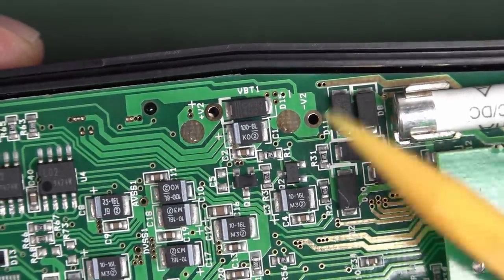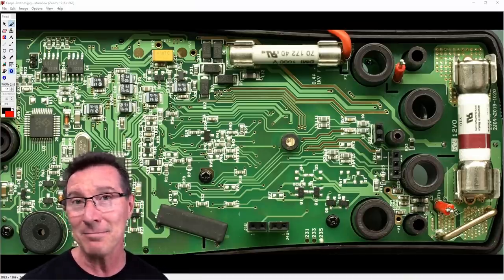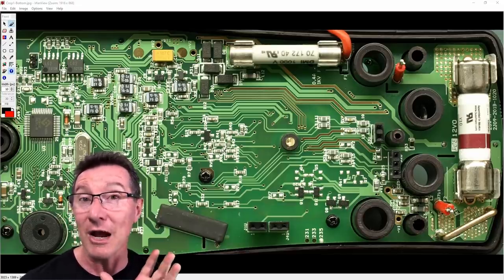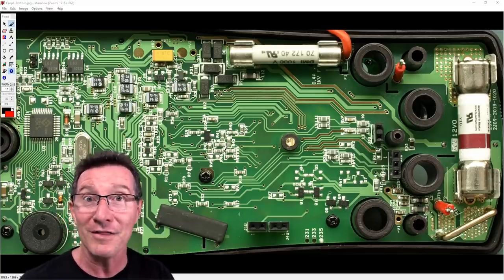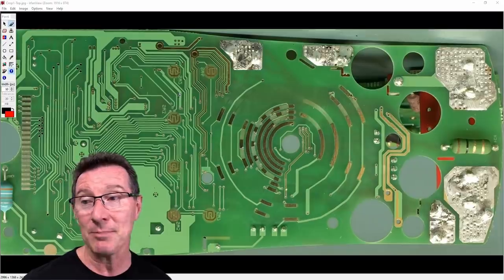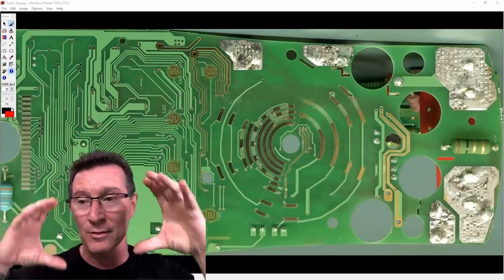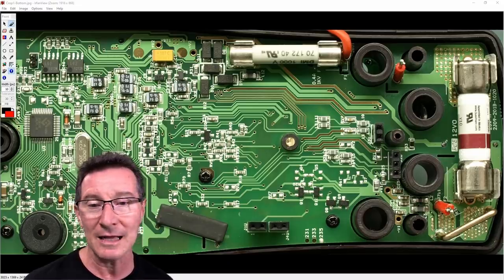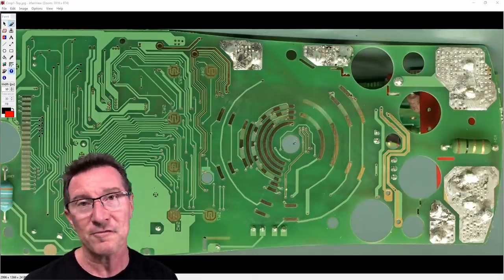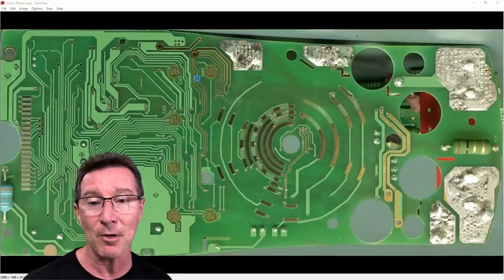I don't have the customer's unit, so I don't know. Now, that diode might not be the only thing in parallel with the battery, so let's have a close look at the PCB here. I've got my original teardown photos, which are included in the manual — I claim it to be the only multimeter manual in the world with photos of the PCB in it. I've taken these photos and skew-corrected them, rotated them, so they're roughly aligned — top and bottom of the PCB — so we can flip between top side and bottom side and trace things.